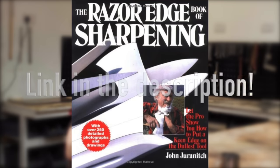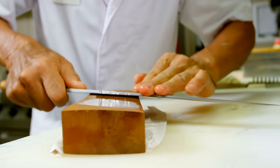There were trials done in the 1980s in the States - I think the book is called 'The Razor Edge Book of Sharpening' or something like that. They did trials in an abattoir where they gave butchers knives with different colored handles, and the butchers found that one particular color lasted four, six, sometimes eight times longer than the others before they had to resharpen them during an eight-hour shift. Those were the stainless steels that were staying sharper. However, a lot of knife makers will say you can't get a stainless steel knife as sharp as a carbon steel knife - you can, it's just not as easy, because you've got those very hard chrome carbides that make your sharpening process a little more tedious and take a bit longer.